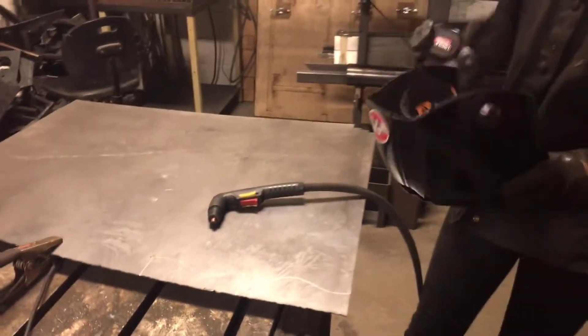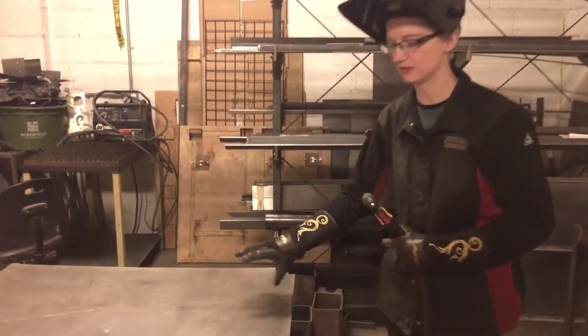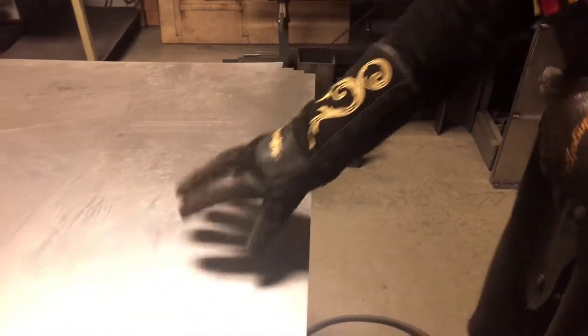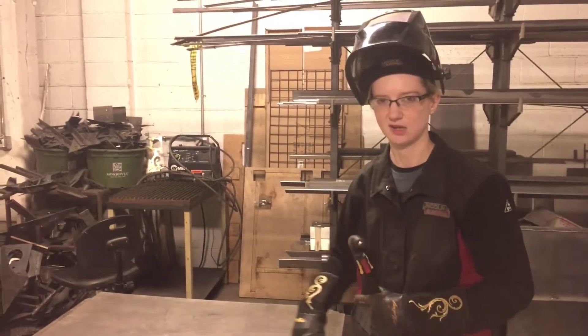To find your settings, I like to do test cuts, which I've done a few over here. This is eighth inch thick material, which is also 11 gauge. I've already set the amperage for that. All machines are a little bit different, so it's best to just do a test cut beforehand.